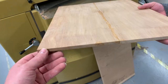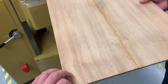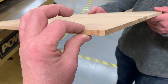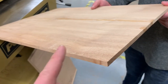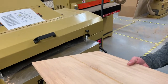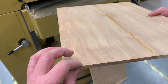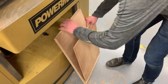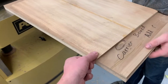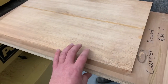After you've glued the two boards together for the back of your guitar, take it out of the mold and we now need to get this down to the correct thickness. Right now our boards are about three-eighths of an inch thick and we need the final thickness to be 0.100 inches. We'll go to the planer first using a carrier board — the carrier board is exactly one inch thick, so we add an additional inch. So with three-eighths inch boards, we type in 1.375, which is one and three-eighths.